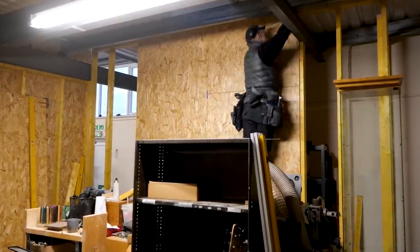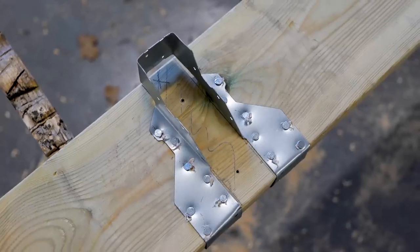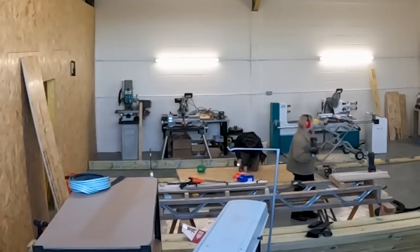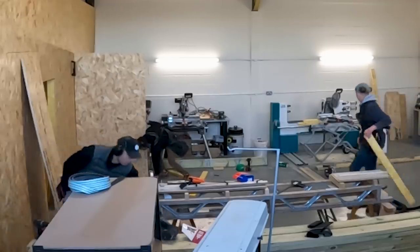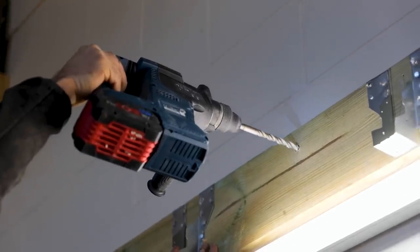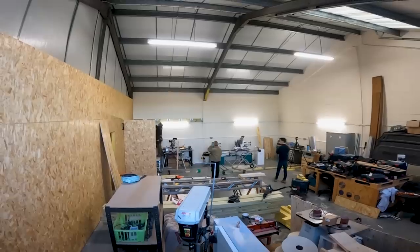Meanwhile I was on the outside setting up the smaller area which was going to have the mezzanine. I've got my pole plate, which is what I'm going to bolt to the wall. Matt was happy on the pin nailer putting all the hangers on — he really enjoyed himself doing that. I was making the first of the frames which formed the wall. Because this doesn't go up to the ceiling, I was able to make these as frames and prop them up in situ, building from one end to the other so the joists overhead could hold it all nice and true. The sleeve anchor fixings are fantastic — we drill the same size hole through the timber straight into the blockwork, and the sleeve anchor passes through without over-tightening. It acts like a pin so all the downward force is supported by a solid fixing.